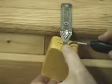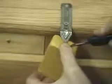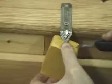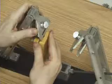The pointy end of a can opener is helpful to start the cut. Notice how the blade is worked from side to side during the cut. This is to establish locks so the mold halves will align perfectly when finished.